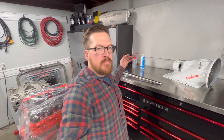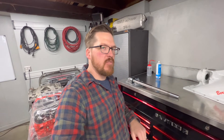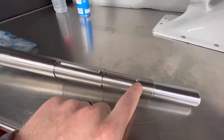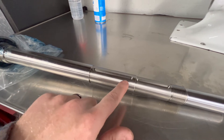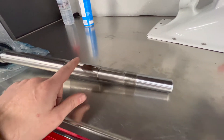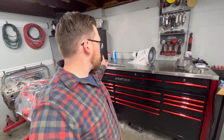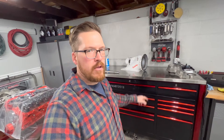Hey guys, we're back and I have my shaft back. Like I mentioned, I sent this shaft off to CP Performance and had them machine it for me - I was returning some parts anyway so it was pretty simple to throw it in the package. You can see here where it was initially machined for the impeller, and what they did was turn down the forward section of the shaft in front of the impeller and add this keyway. That's what I needed to allow the inducer to go on with the spacer and get everything clamped. Just like disassembly, I need to reverse the steps - get the shaft back in the housing, then fit up the inducer and impeller.